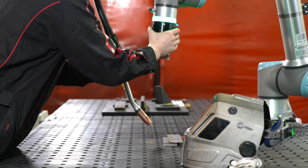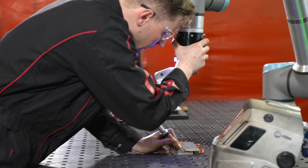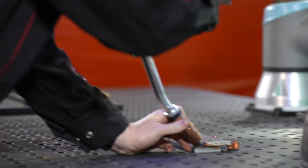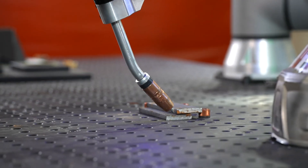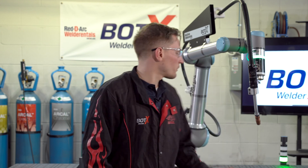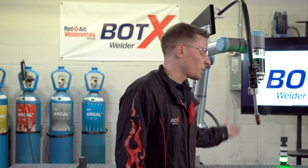Here's the start of this weld segment. Now we're going to move the robot into the termination of this weld segment. We're going to save this program and create a new playlist with this part. Before welding, to validate the path that we took, we perform what we call a dry run. This is a non-welding path that the robot will take, so we can visualize what this program actually looks like before we weld our part.